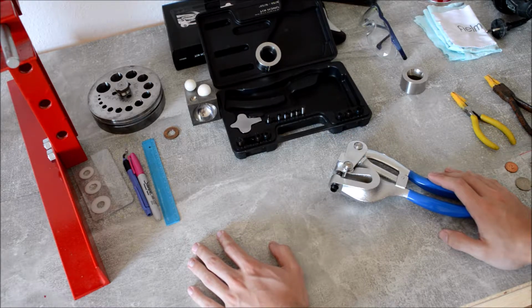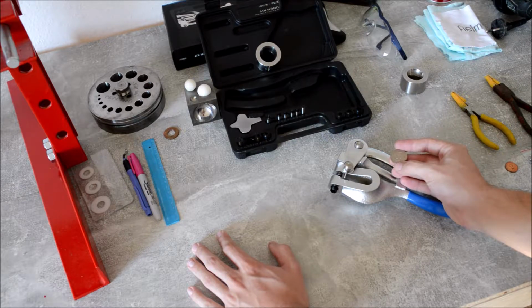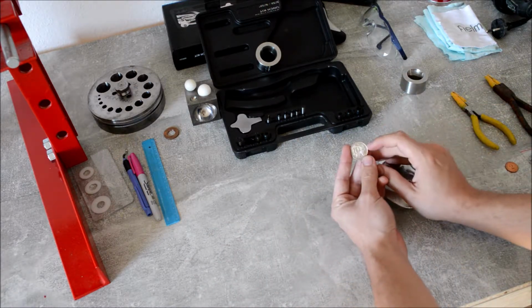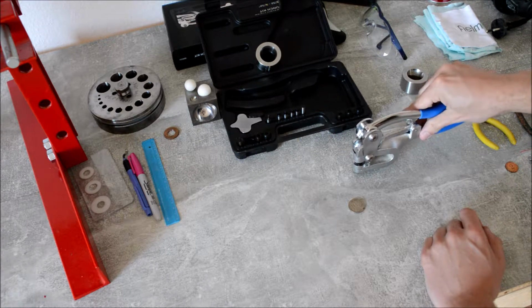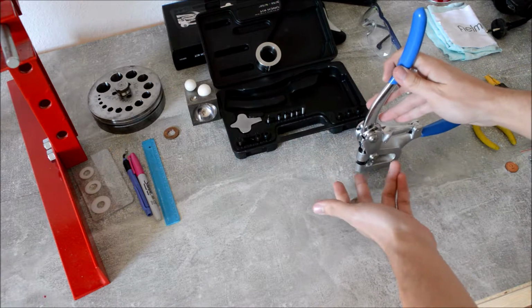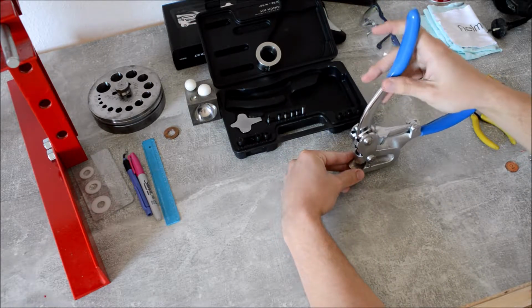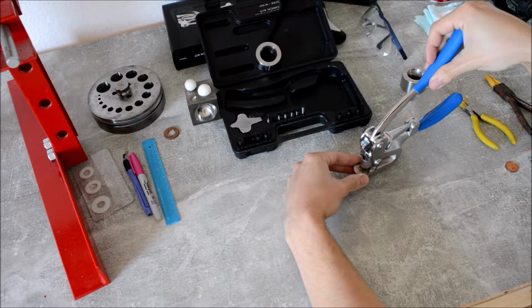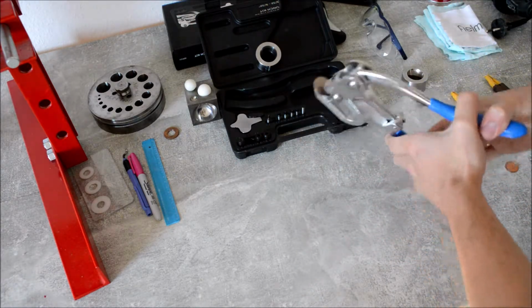how to use it. So that's an Australian coin. Normally you should polish them before you make a pendant out of it, but I just thought to show you how I do it, I just take a coin. I think it will look good if the hole is about here. So I take the punch, put it on the table, then I take the punch up, I put the coin under it, then I will look where the hole will be. Yeah, that would be fine. Now I take the punch and push.